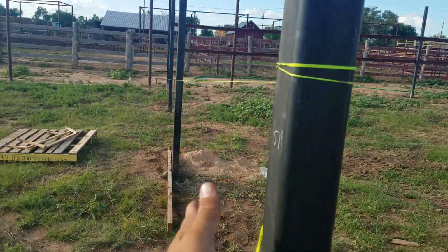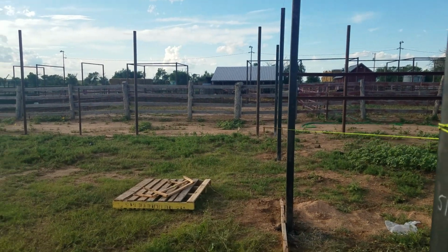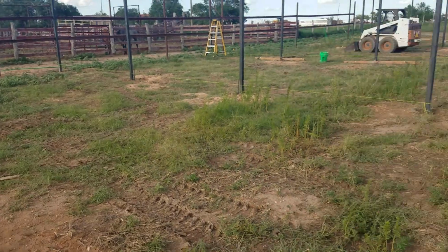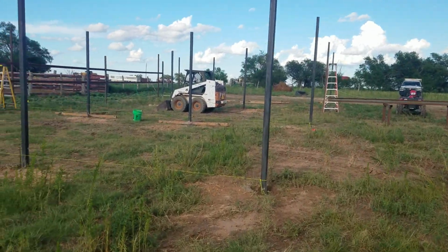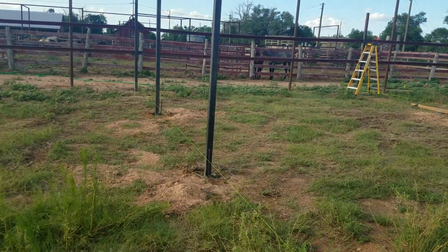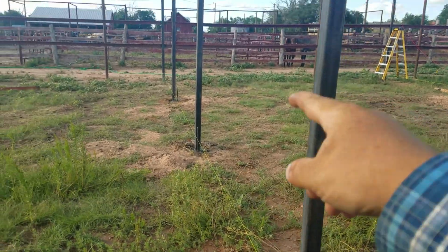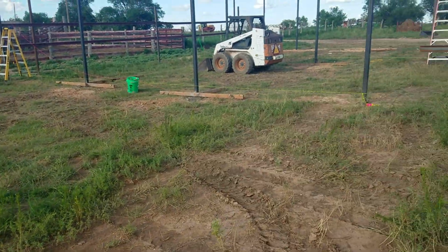This will be an end wall here. There's the opening of the alleyway that will bring cattle down this side, and we've actually decided we're going to have this alleyway here, but we're going to have a feed pen go on this way, because we're going to have 2 feed pens here, so might as well build another feed pen there. This will be just an interior part of this. We'll be putting our concrete pylons, our bumpers on these posts, because this will just be a dead spot in the pen. That way, when we're cleaning the straw out of here, we just don't beat the hell out of it.